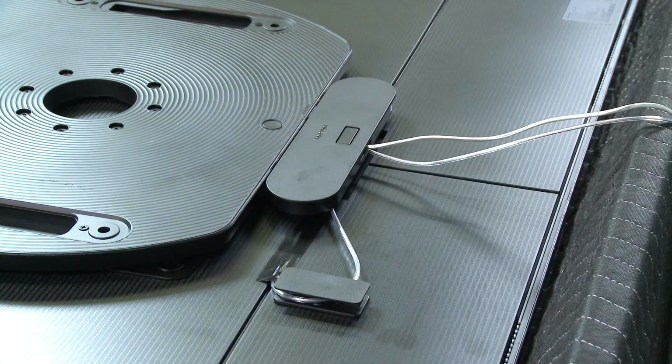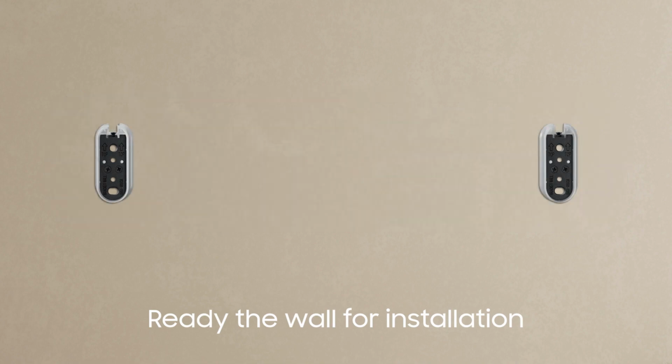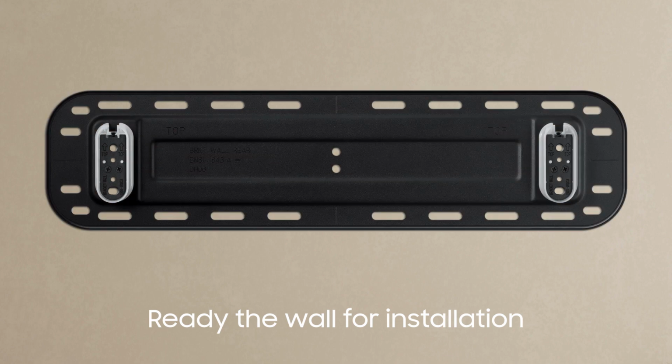It's time to prepare the wall bracket. Now, there are 2 different ways you can mount your TV to the wall, with the wall reinforcement bracket or without. Generally, for brick or concrete surfaces, the wall brackets will suffice and can be leveled after the fact to fine-tune your placement. For drywall installations, you'll need to use the reinforcement bracket as well.